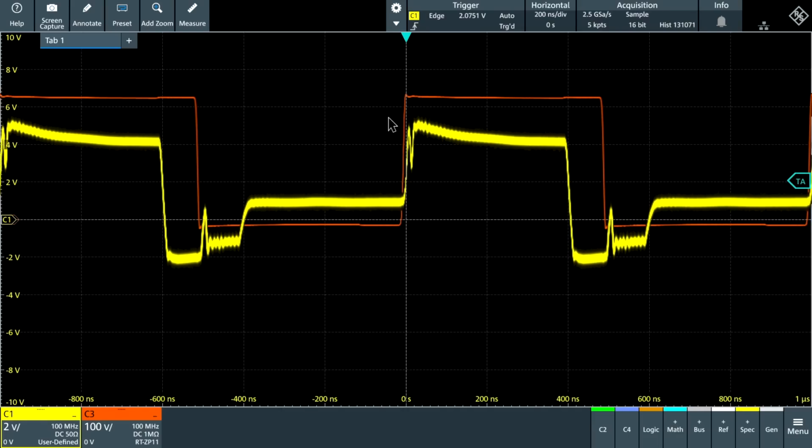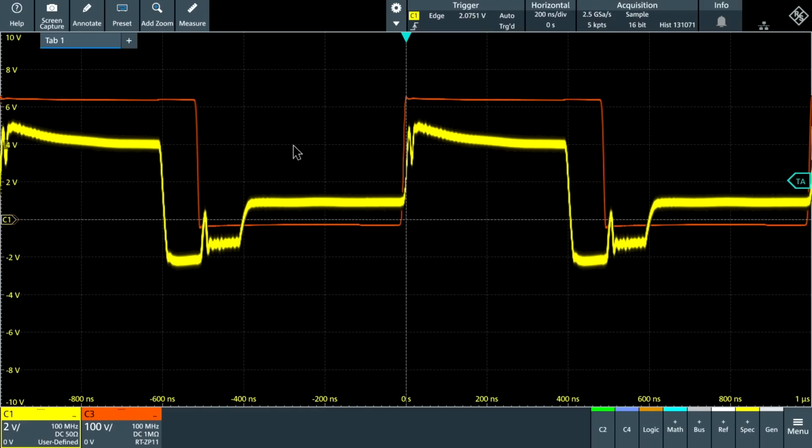Remember that this huge waveform sitting at 320 volts peak to peak or so is appearing in common mode, but the probe completely rejects it. This is really quite nice. And I should be able to increase it a little bit further even. And here is 400 volt power supply, which is the maximum I can do with what I have. And look at that. That's really incredible.